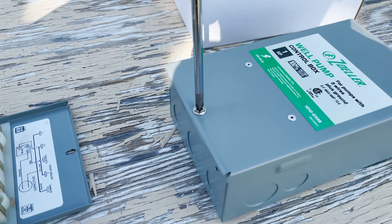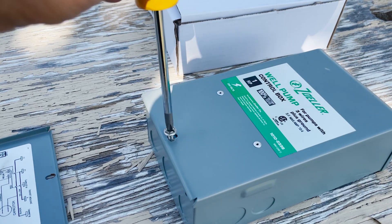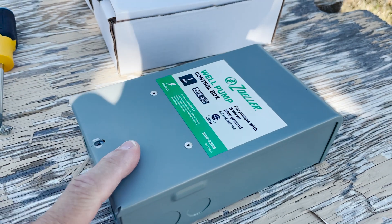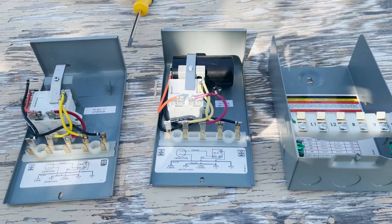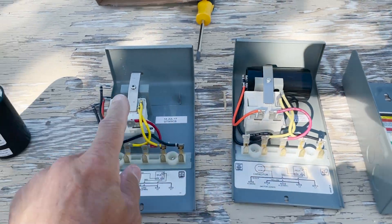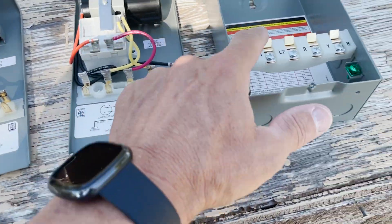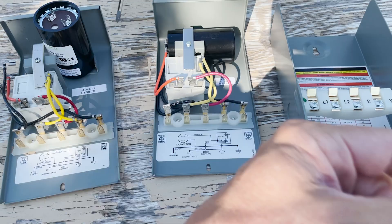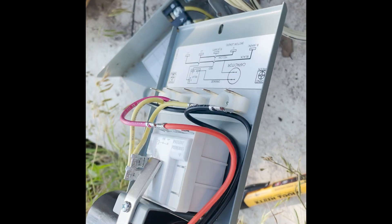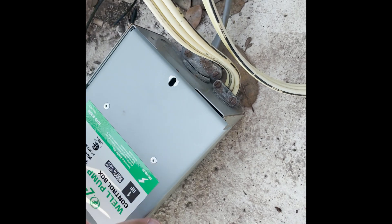This is why I suspect there's a pump mismatch or some other issue — the control box may be for a one horsepower motor and the well pump may be a one-and-a-half horsepower motor. So there it is: the broken one, the new capacitor that I need to put in, and the new one with capacitor plugs. These should look familiar from the box we've videoed previously. I'm going to take this piece and plug it into the old one — line up the spades and plugs.